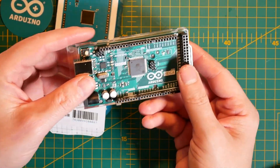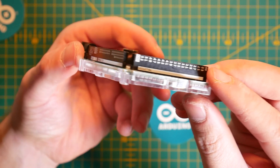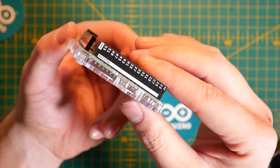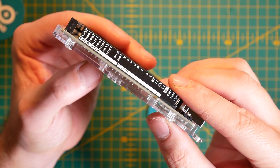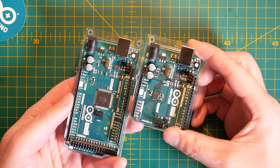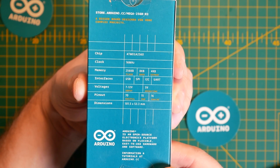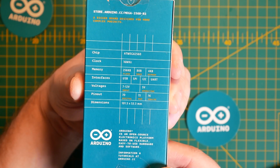The next board in the Arduino Black Friday lineup is Arduino Mega, and it's an excellent and very popular board among makers for a couple of reasons. It uses ATmega2560 to manage all 54 GPIO pins, just like the Due. Unlike the Due board, it does use 5V logic, so you will be able to take advantage of a couple of things — it's compatible with Arduino Uno shields and add-ons, so you can just pop them on top of the board. If that isn't enough, you can take advantage of the 54 pins: 15 of them are PWM signals and 16 of them have the ability to process analog inputs. The board is going to be on sale for €29.75.